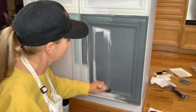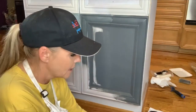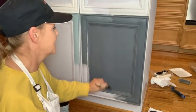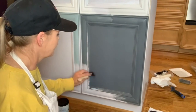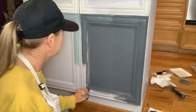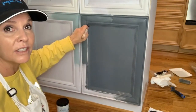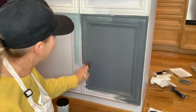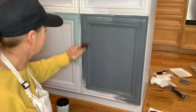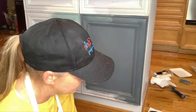I'm going to get this door and this drawer done and then move over to Silk paint. Silk is actually very smooth going on and has such a beautiful finish — you don't have to seal it, but I have two dogs and I want that extra protection. Make sure you get in all those corners, especially when using water — you don't want paint to accumulate in the four corners or any drips. You want a nice smooth finish with a very thin coat.